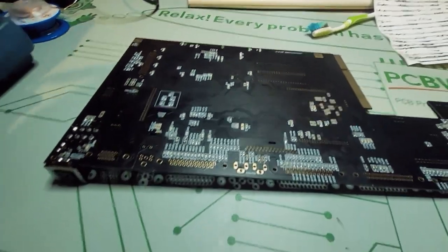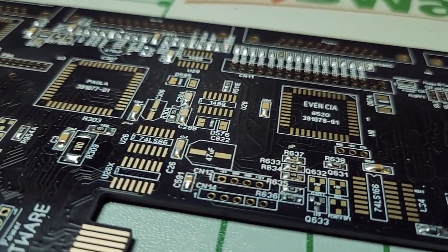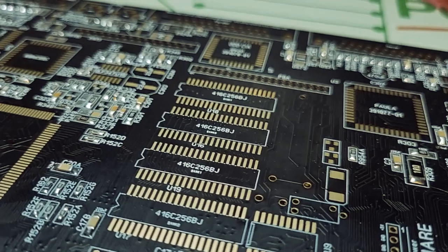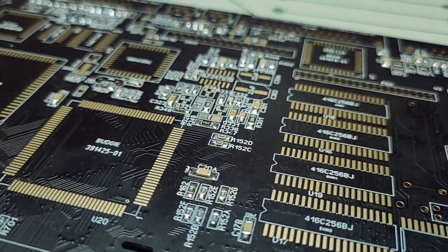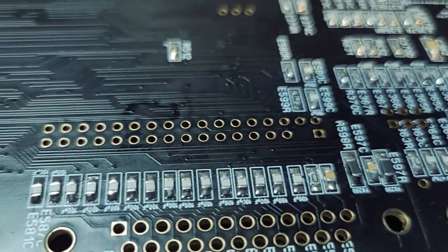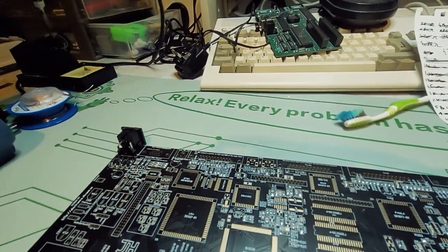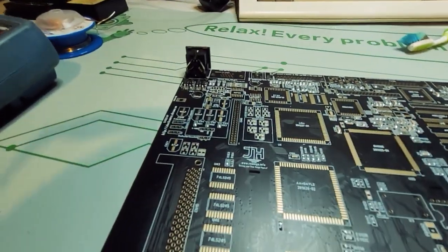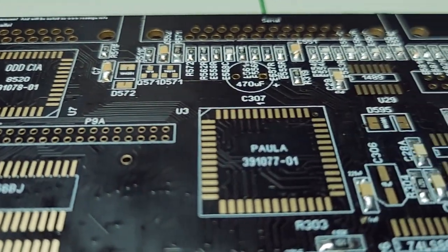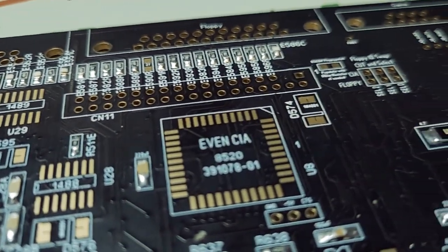All right, so that's all of the resistors and capacitors in. I lost count at some point, but I think there's around the 250 mark here and close to 200 here, something like that, probably more. It's a lot of little bits to solder, but I think I did an okay job. I ended up getting myself one of those flat knife-edge type tips for my soldering iron, and I think that works great. I should probably have gotten one ages ago, but it's very handy for this type of stuff. It really gets in the corner.